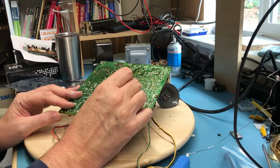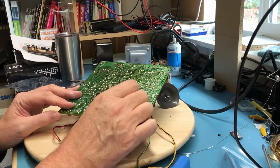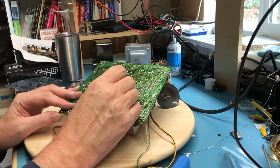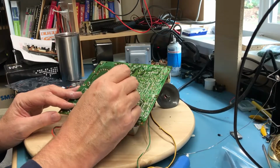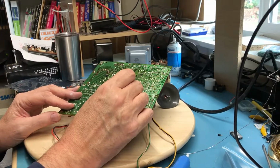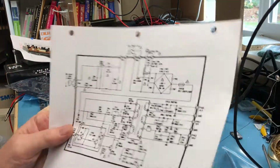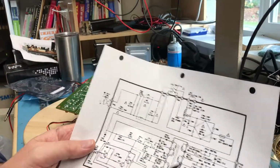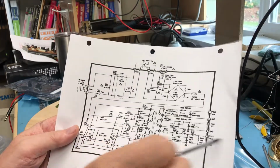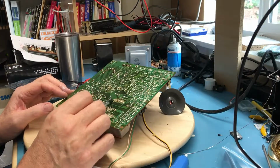However, when I look, only 3 of the pins are used, and that's this pin, and this pin. It's a single-sided load on the board, or a single-sided PCB. That pin's completely isolated. That pin's completely isolated. And as best as I can see, that pin's completely isolated, which immediately says that this power supply is much different from this one, in that this has got 3 secondary windings to produce 3 different voltages, and this seems to have a center tapped secondary winding, and that's based on putting the ohm meter on it.